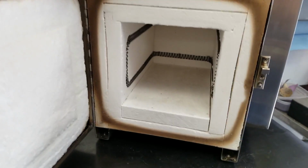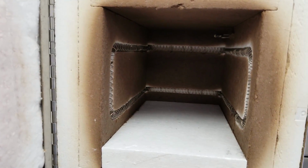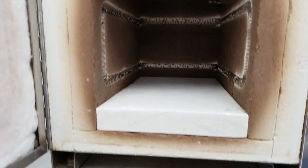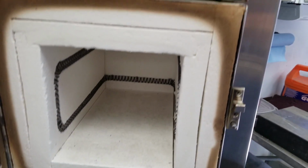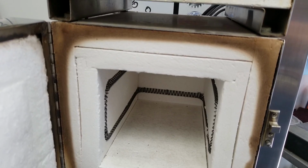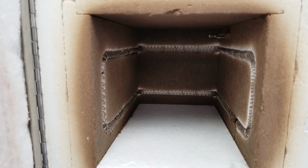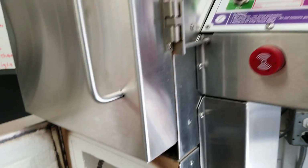And you can see from the chambers, this one's still very brown. This one never made much temperature. This is a 600 degree oven on top. Those are your tempering temperatures. And down below we've got a 2000 degree oven. So you can see that brown ring has moved away from the working chamber. So we've got two environments controlled by two separate temp controllers. One is a hardening temperature, one is a tempering temperature.